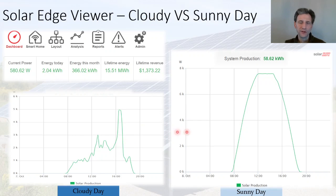On the sunny day you can see the sun comes up a little before 8 and ramps up very steadily, then there's this little cap — and that's showing the clipping. If I had a larger inverter, say a 10 kilowatt inverter, this would continue to rise up to 9.38 kilowatts or maybe more, giving a very nice parabola. But the inverter maxes out at 7.6, so you clip or lose that little peak of energy that could have been produced.